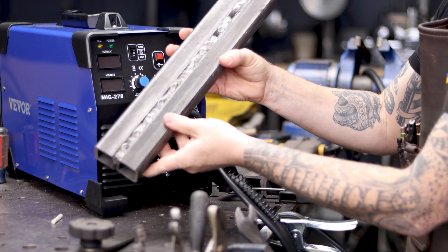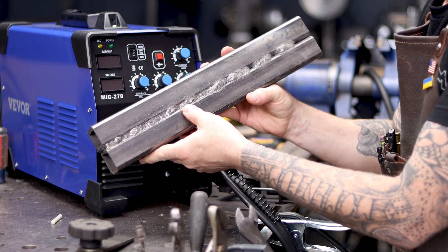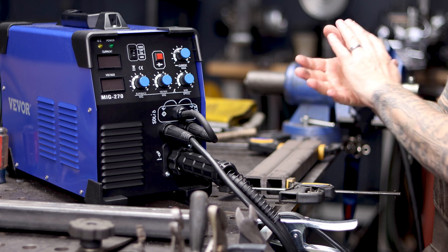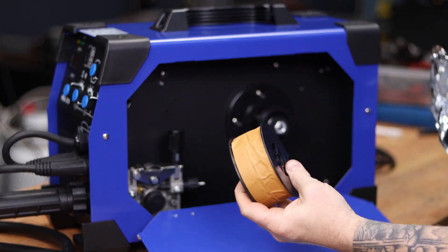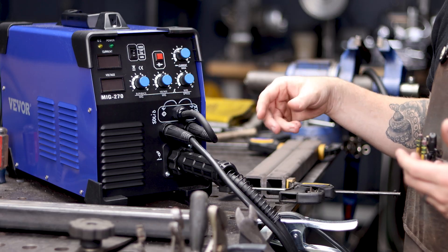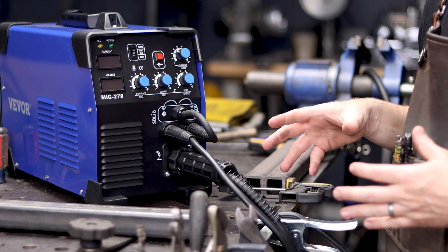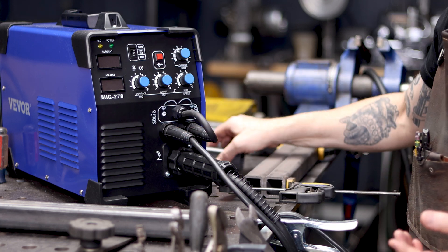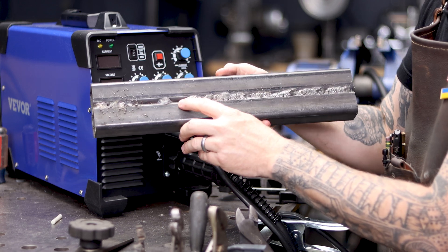Initially I started with this piece of steel here. These aren't the best welds in the world, but these two pieces are just designed for me to learn how to use this machine. The other philosophy I like when I get my hands on a new welding machine is that spool of wire they give you initially — that's just a freebie. You should burn through all of that on scrap steel and learn the machine. That is part of your education. Twist the dials, change your amperage, change your wire speed, and get a chance to figure out how this machine behaves with the particular material you're working with. Tube steel is really great because it's got radiuses built right into it so you can lay welds right down into it.